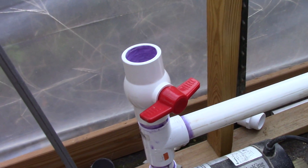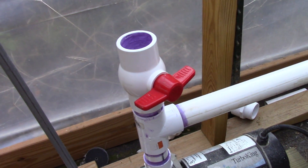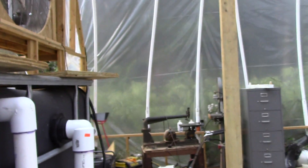That's the valve — if I need another overflow valve I can use that, or if I need to divert water anywhere else I can use that. I found out three two-inch drains are not sufficient to drain out what's coming out of this one and a half inch pipe, so I've got a bypass and this is how I adjust the flow on it. This water comes straight out from back to front, which keeps me from overflowing these tanks because my pump is so powerful.